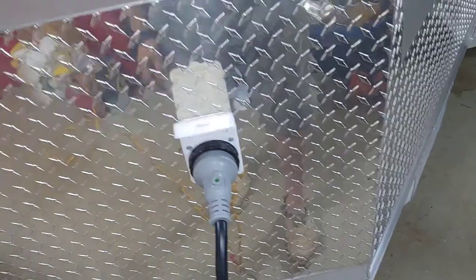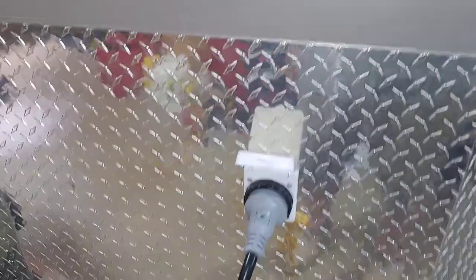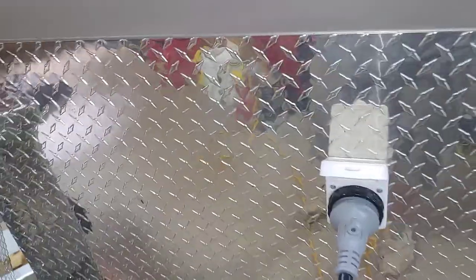It's feeding a breaker box on the other side with 20 amp breakers as well as 15 amp breakers, and then there's a main 30 amp breaker. I've got it temporarily hooked up to a 15 amp extension cord because this is 110 — do not mix this up with 220, because it might look like a dryer extension cord but it's anything but. You'll mess up your systems if you mix those two up.